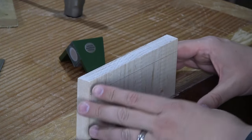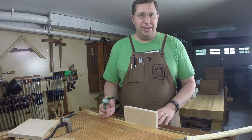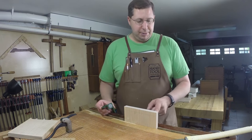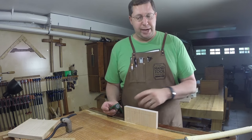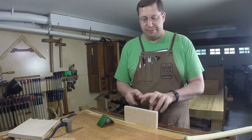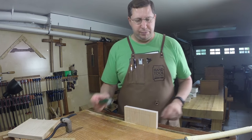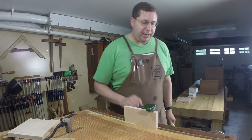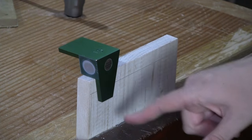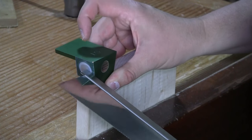I've got my tail board locked up in my front vise, and one of the first differences you're going to see in using one of these guides is the layout. Since this locks in the angles and everything, all I really need to do is scribe my baseline to know when to stop cutting and a location to start each cut. I just laid this out by eye — visually cut it in half and then cut those parts in half, so I'm going to have four tails — and then made little tick marks about a sixteenth of an inch away from those lines. I take the guide and set it up so that the angle is going to be cutting from the top left down to the bottom right, and I can just slide it over so the guide matches up right with my tick mark.